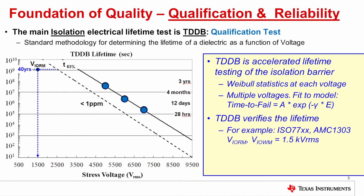In addition to the working voltage, this data can also be used to assess the margin above the isolation rating itself, VIOTM. VIOTM or VIISO are rated to have 60 seconds required at the rated voltage, and so you can see the symbol on the curve for VIOTM at 60 seconds at 5.7 kV RMS. Looking up from there, you can see that the actual data is several orders of magnitude above the requirement for VIOTM isolation. This requirement for TDDB data is now part of the VDE 0884-11 standard, and this is the first technology to certify to that standard.